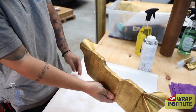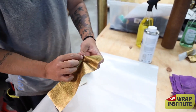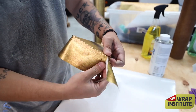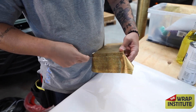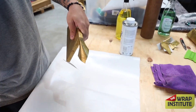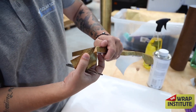Now it's time to focus on the sides — there's a huge amount of tension built up because of the giant 90-degree drop-off corners. It's very important to get this right. Because he made a relief cut at the bottom, he can take that tension out nice and easy and wrap around the bottom. He makes a cut flush on the top section, picks it up to wrap it around, then flush cuts the back. Since this is on the side of the drawer and not highly visible, he takes the overlap away from where the client is looking — they'll open the drawer and look down, so he directs the overlap to the other side. Very clever from GMS.